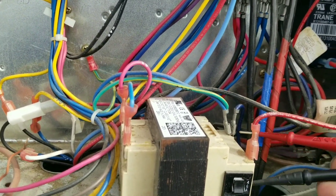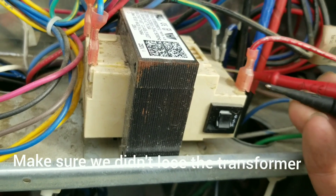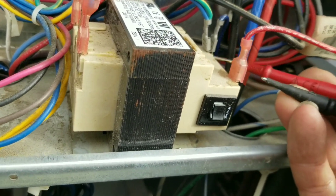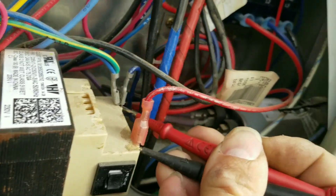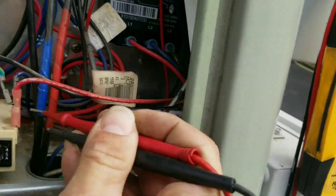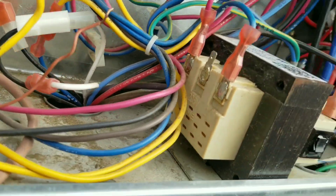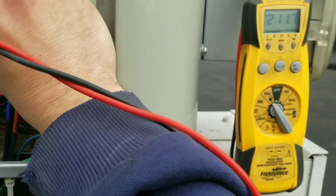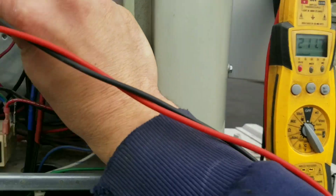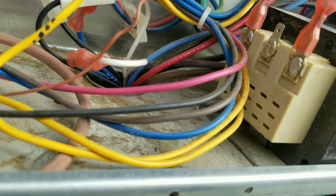I do have — assuming I have 24 volts — it's not going to do me any good checking if I don't have 24 volts. We got 23. I'll bet we're tapped wrong, and that may have been what killed the board. Over time with low voltage it will do that. And you can see 211 volts — so we should be on that 208 tap.